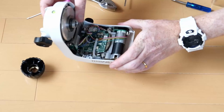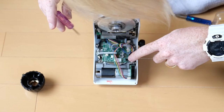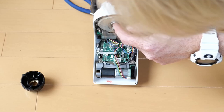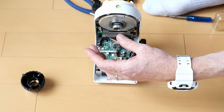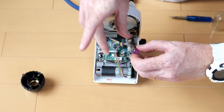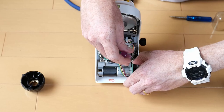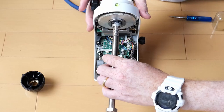We've removed the cover and can set it aside. Now we're into the dirty part. The motor is here, the worm is here, and the gear is behind it. This is the RA axis; this is the declination axis. The grease looks terrible. In my case there was grease all over the clutch ring as well, which is probably not good. The mount was also very badly set — the worm and gear were nearly unmeshed.